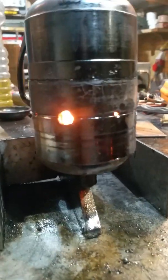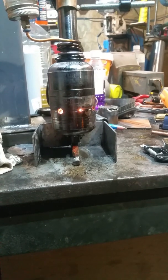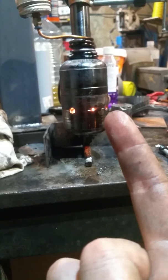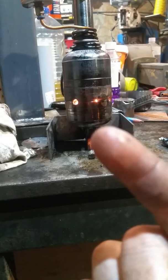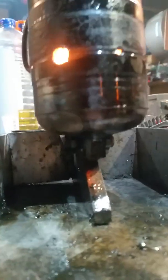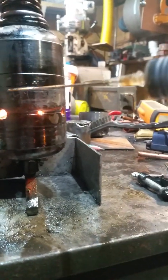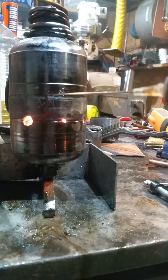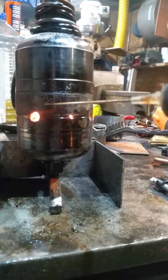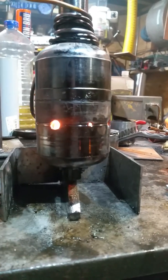Very, very pleased — it's lovely and warm, actually probably a bit too warm. All this is is a series of holes evenly spaced every 90 degrees, and I've got some at 45 degrees in between, ready in case I need to drill more. I've got a 10mm tube welded up into the bottom, and it comes out around about here — that's the join between the upper and lower part of the chamber, about halfway. Then it's just a straight pipe all the way up.